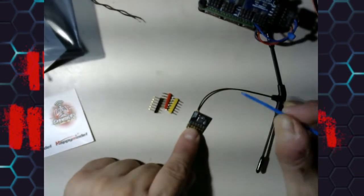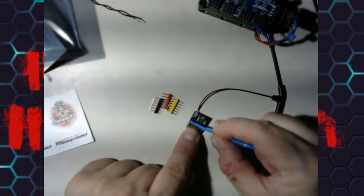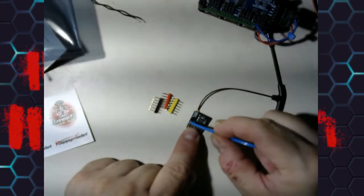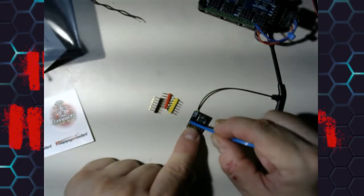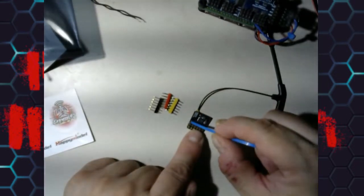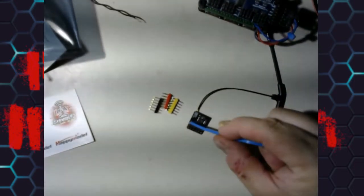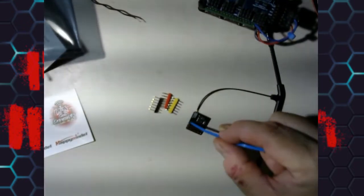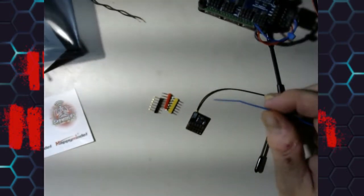So when you're soldering it, even if you're soldering it completely correctly and nothing wrong with your soldering technique at all, just the heat from your soldering iron could possibly damage this or warp this just enough to screw up the negative, and that would connect the negative to your signal wire on number 1, which is how you put it into bind mode. So if somehow that gets crossed, and even if it's just a fault in the board when it's being manufactured or shipped that they don't catch, any bridging of that will put it permanently into bind mode, and not even flashing it will solve that problem.